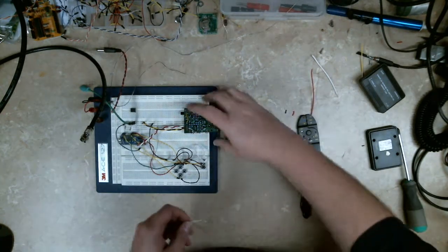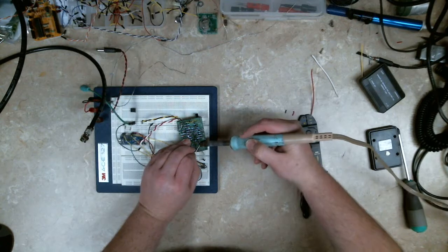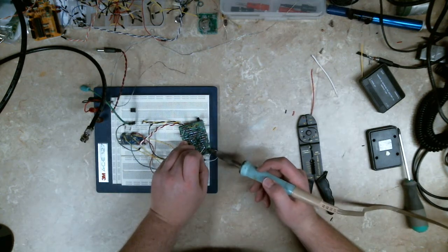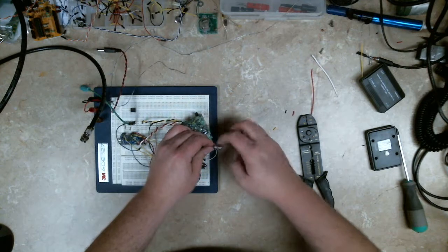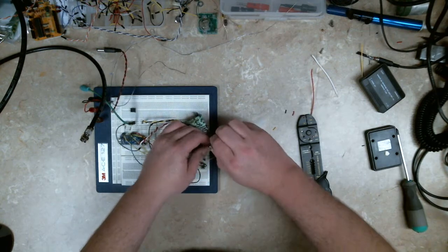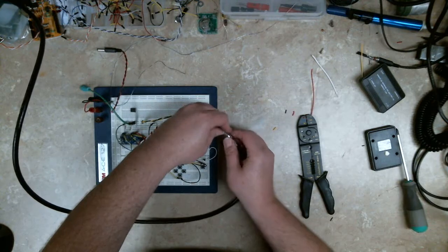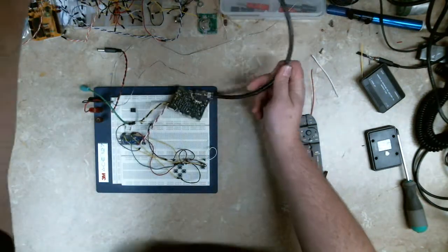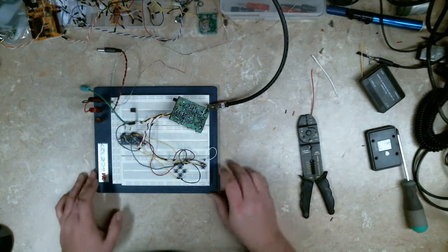And that's the video here. The RF output is this big pad up here. Right, and this other big pad is where the shield on the coax went. Okay, so this was loose. I'm going to tighten this up so the ground is solid. Yeah, as solid as it gets. Always a bad idea to have a loose RF ground. Doesn't do you any good. In this case, I can't tighten it up any more than that, unfortunately. So, here we have a giant piece of coax. It's going to want to drag everything across the room connected to our RF modulator.